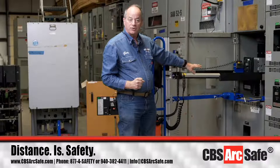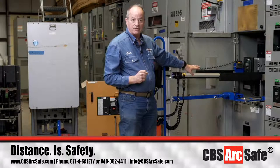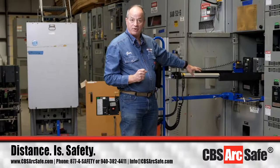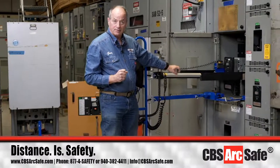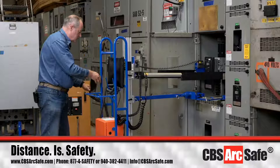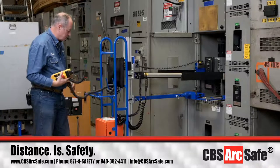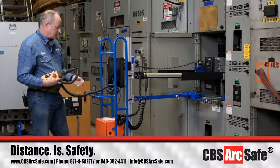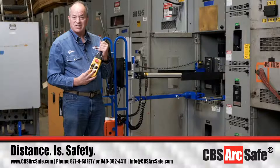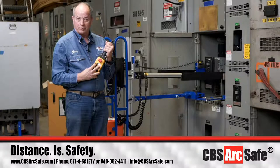As we go through this today with the DB50 and later the MA250 or MA350 breaker, you're going to see a cabinet attachment that gives us a fixed reference point to pull and push from. We have our standard pendant here that gets us approximately 30 feet or 10 meters away. We'll turn on the power and it boots up. The bottom two buttons are usually our secondary actuator, and the top two buttons are the primary actuator for pushing and pulling the breaker.